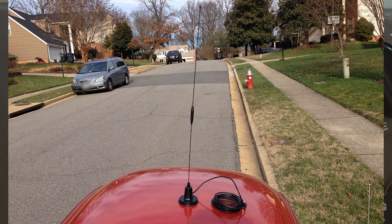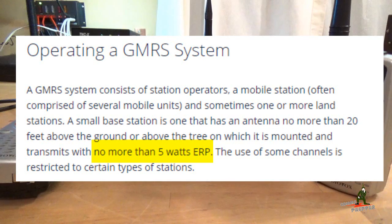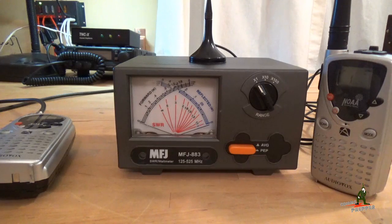That's why I really like the DPD commercial antenna. At $70, you're going to get the most out of your radio equipment if you use GMRS as part of your emergency communications plan. I'll put links below to formulas on effective radiative power. FCC regulations prohibit exceeding an effective radiative power of 5 watts. The DPD antenna has 5.5 dB of gain, so you have to know the output transmitter power of your radio and use those formulas to make sure you're staying within the regulatory limits set by the FCC.